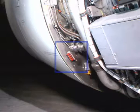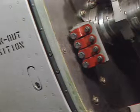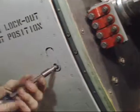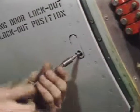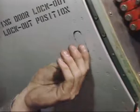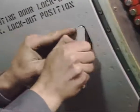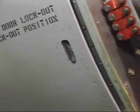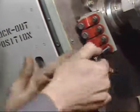For lockout operation, on the lower forward face of the right thrust reverser half, lockout bolts will be removed from their storage bracket. On each pivoting door, remove the lockout fairing and its screw. Then remove the red lock plates and the lockout bolts.